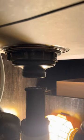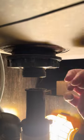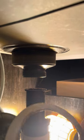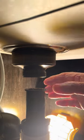I've also purchased the tool for removing this nut, mostly for putting the new one back on so that it ends up straight when I put it all back together. As you can see, the only thing down here is the friction gasket and it's deformed because of the way it was installed. In fact, it has crud on it because it's really not sealing correctly. Next thing we'll do is remove the drain from the top.